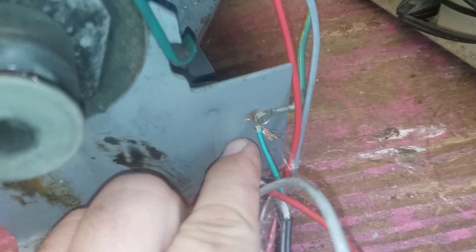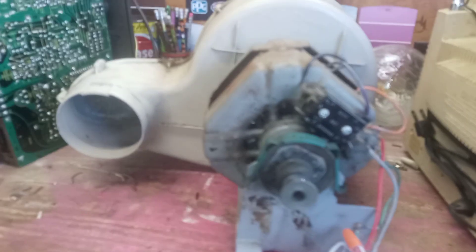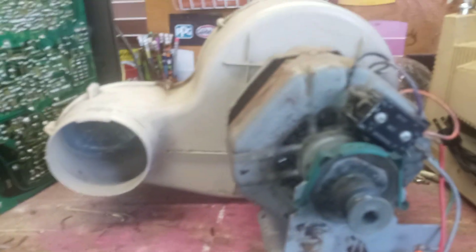I wired it to a cord. I always like to use a ground wire - you would just ground your green wire to the casing of the motor housing, the metal, just as a precaution. Now this cord I've got in here is not really heavy enough, but it's just for a demonstration. I have to kind of hold this thing one-handed - when this thing starts it's got a kick - but buddy, it works and makes a nice little shop fan.